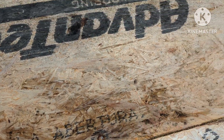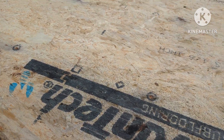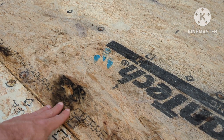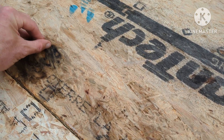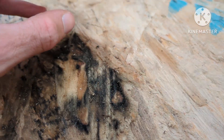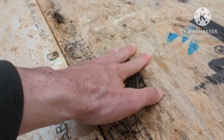So I don't want to go ripping this up — it's all tongue and groove. And if I start messing with ripping out holes, then that tongue and groove isn't going to really apply anymore. So what I'm going to do is just keep airing this out, focus on getting the framing done. And if this becomes a problem — can I rub it off? That looks pretty surface to me, that black stuff for sure. So I can clean that off. The only question is the slight swelling — it's very, very slight.